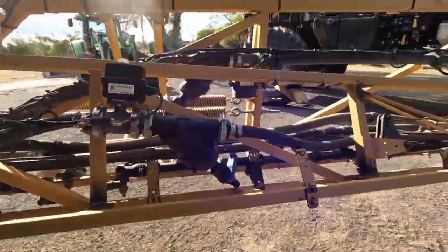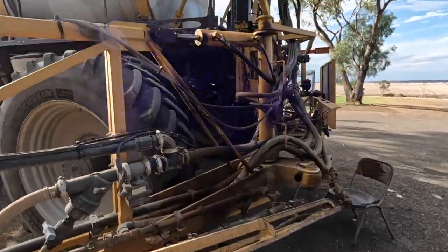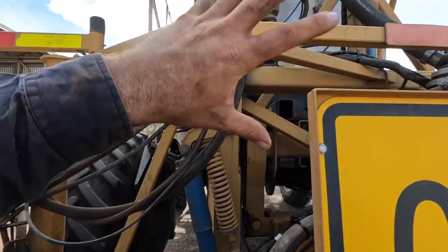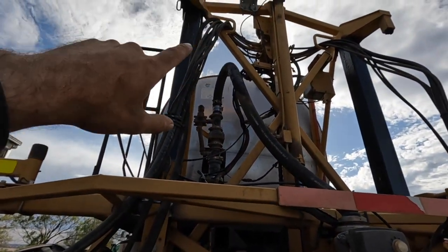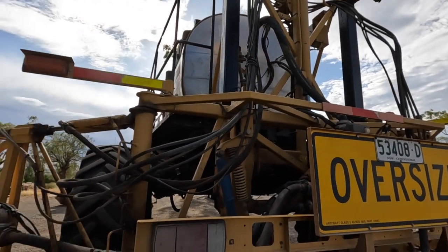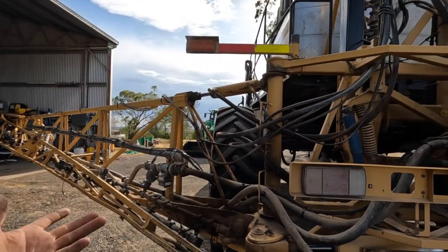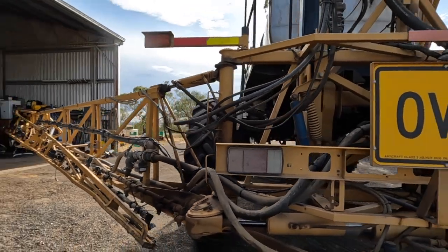There's four wires, so I've run that all the way along the boom and up all the way to bypass the boom harness and this center harness here, and it goes up to a plug up there. So that way, if we don't have any more issues with it, then we know that it's this harness here, which we can either buy a new one or, anyway, we'll know more at least. So that's just quickly what we've done this afternoon.